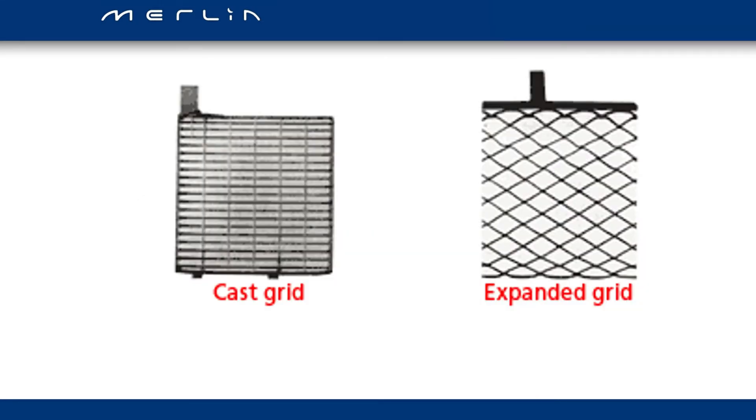The quality of the grid really does affect the overall quality of the battery. Most low cost batteries are made with expanded grids — a plate of lead is stamped and then pulled apart to create a grid to which they paste the active material. That's obviously not very strong. Full River batteries have a fully cast grid: hot lead is poured into a mould to create the grid structure. It's much thicker, much stronger, and you don't get lots of sharp edges on the sides of the grid. Those sharp edges can cause short circuits inside the battery.